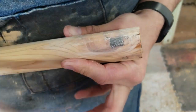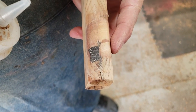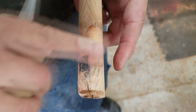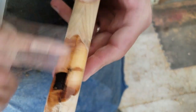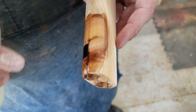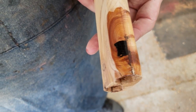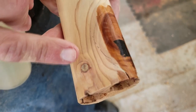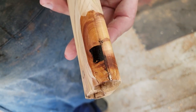Because I'm not finished with this flute yet, I'm hesitant to oil it right away, but I do want to show you what it looks like. I'm just going to put a dot of our oil mixture here on it, just so you can see what happens when the oil touches it. The same thing would happen if you lacquered it or shellacked it, if that's the direction you're going with your woodworking. That looks just amazing. This guy over here doesn't look bad at all in my opinion — it's unusual, but it is a knot. I would go ahead and oil this one, but I need to go back and glue it, and oil and glue don't mix as well. It's best to do the glue when the wood is dry.